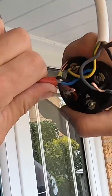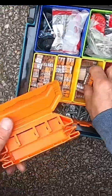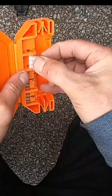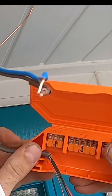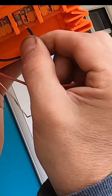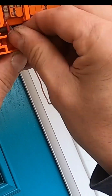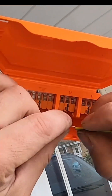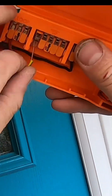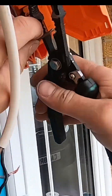So we're going to put ferrules on them to make them look a bit neater and to get into connections a lot more neatly. We're going to strip all the cables back just so we've got a nice tidy fit. This is the new box we're putting in — the new quick-fix box. It'll just come perfectly so you can put these Wagos in the certain locations and then clamp the cables in to be able to terminate nice and neat. As you can see it's a little bit fiddly, but they're a lot more easier to work with than them old brown junction boxes.